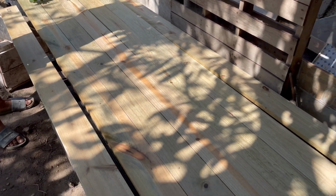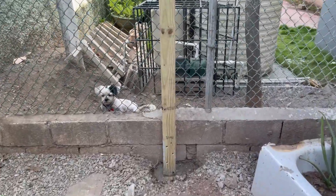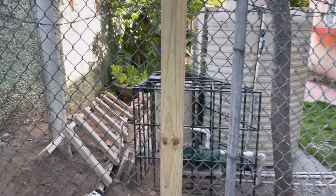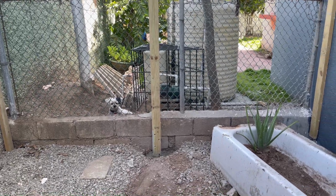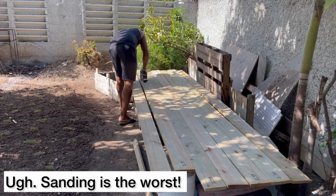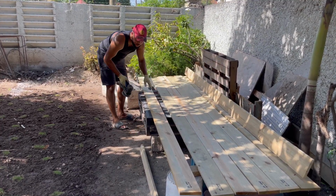Alright, so we're using 1x6 and our 1x3s are over there. And let me just show you the post from last night because it got dark, so we couldn't really see. This looks set to me. Yep. So 1 4x4 and 2 2x4s, which we need to cut the top of this one and this one, and then we should be ready to nail up. One down and 13 more to go. 6 are the big ones.